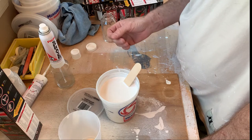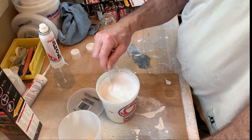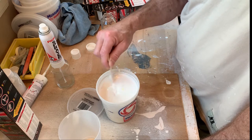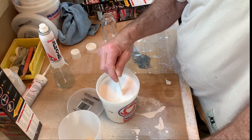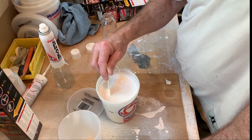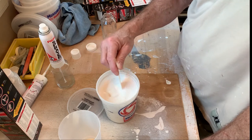And again, when you're painting with an oil-based enamel, which you're typically doing on cabinets and any of your trim work in your doors, it's kind of a pain putting an oil-based enamel on with a brush, because what happens is it flashes very quickly. And then if you go back even as little as 1 minute later, you go back to brush it again with the brush, it starts smearing and you don't get a good finish.